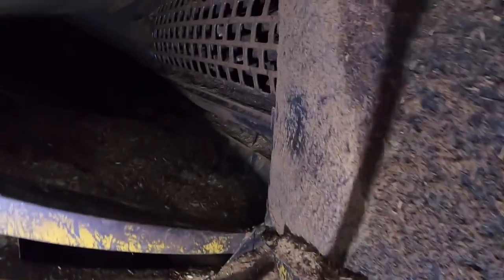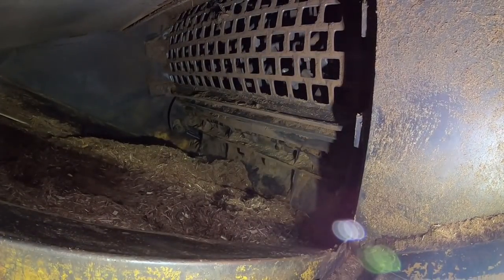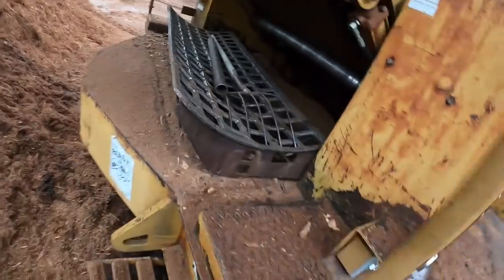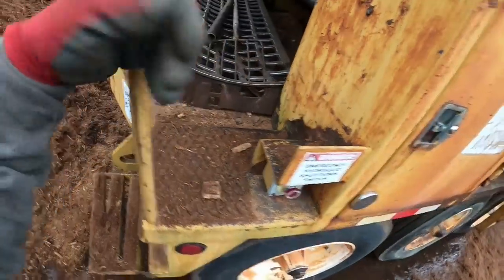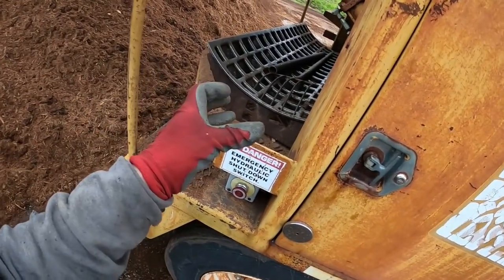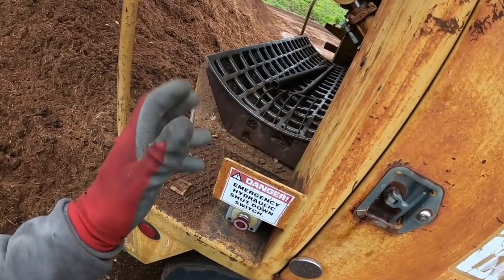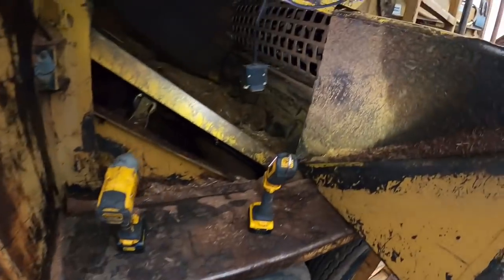What we normally do when we do wood dough is we do a baffle screen. It's on the back right here. You see that? Now, baffle screen's got the baffles on the back. That's what them plates are, and they keep the pin chip. So if it throws out a pin chip, it hits the baffle, gets bound up in there, head comes around and smacks it off. So you don't get pin chips. Now, it's not a perfect world, so you get a pin chip every now and then, but very, very seldom do you get a pin chip. Well, the new screen does not have baffle.